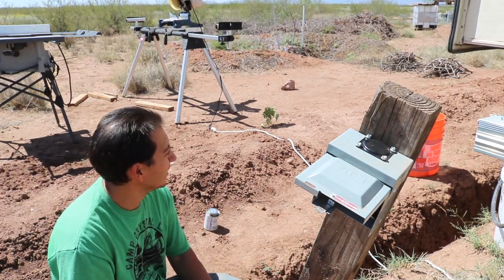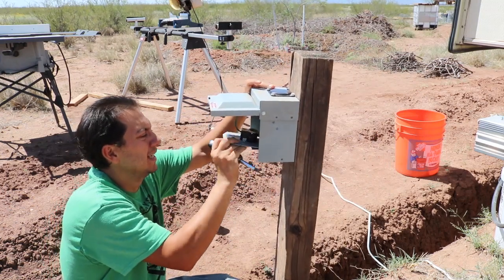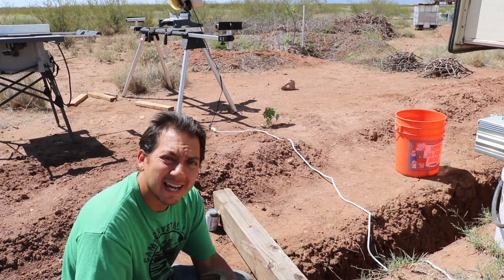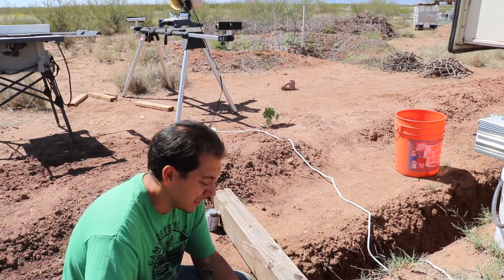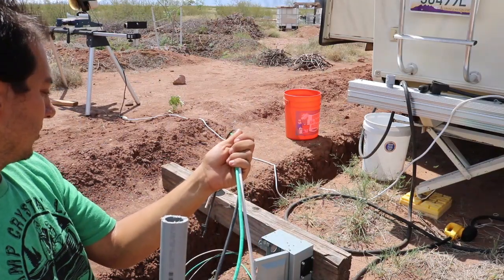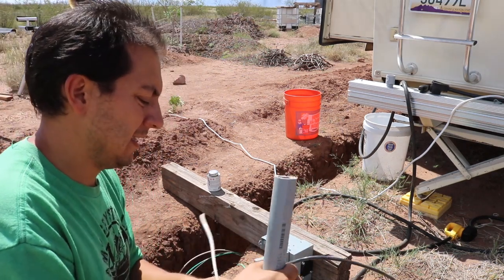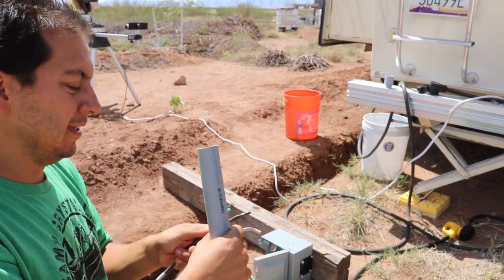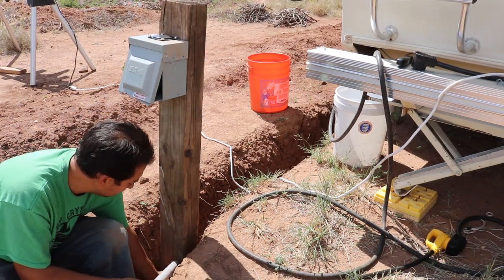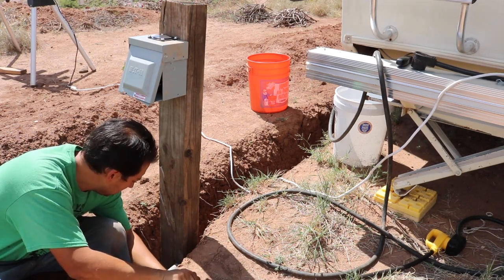It's still been warm out here in southern Arizona — almost about noon, sun's up high in the sky, and when that sun's directly on ya, it's pretty brutal. You get a little bit of shade though, it's not bad. I'm not crazy about these knockouts on these things; they can be a little tough to get off — wish me luck. This one's looking like it might be a little easier to get out. I definitely got some extra wire here; at some point I'm going to have to cut these. It makes me a little nervous cutting the wire — I'm always thinking I'm going to cut it too short, so I'm saving it for last. I got my little connector piece right here. I'm going to put a little bit of PVC glue on the male end and knock it in so that it touches the wires itself.